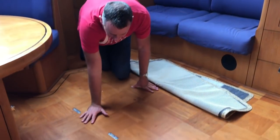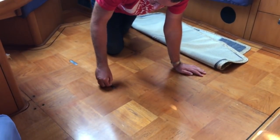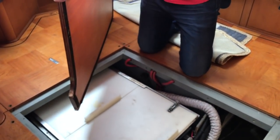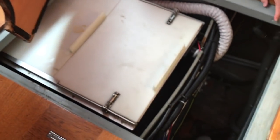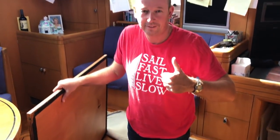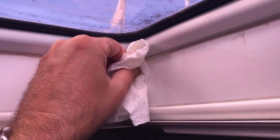Every morning, or at least every few days, survey the bilge for water, oil, or fuel leaks. It's good to get in the habit of lifting a central floorboard often just to make sure the bilge is dry. I especially lift the floorboards after a heavy rainstorm and when turning on the engine or generator if it hasn't run for a while. Leaks can come from a variety of areas — we've had a fresh water shower hose form a slow trickle through to a busted hot water hose causing the floodgates to open.